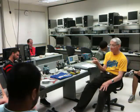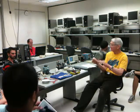One way I propose is to have a little lamp and drive it with approximately 4.5 volts peak sine wave and see how bright it is, and then switch to DC and adjust the DC until we get the same intensity. If it's a hot filament type bulb, not an LED and not a fluorescent type, just a hot wire type thing, then it should respond to RMS some way, and then to DC it should respond some way, and we'll find out if the numbers correspond.